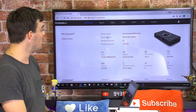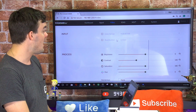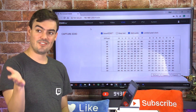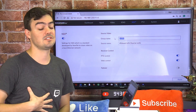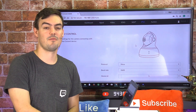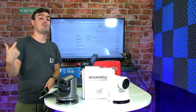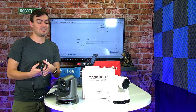There's also information about signal and video format. It can ingest 4-4-4 video, but it does 4-2-2 when it streams. It also supports EDID, so you've got all your EDID information. You have NDI settings — if you're grouping NDI sources as we do, you can set them up in groups. And then the most interesting portion for me is the PTZ section. We have VISCA over IP, and baud rate and camera number settings, which means we should be able to control multiple cameras off a chain — extending VISCA. Very powerful stuff, if it works.